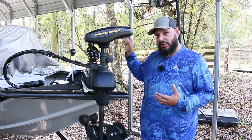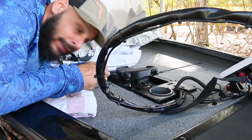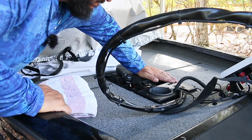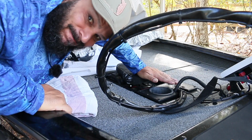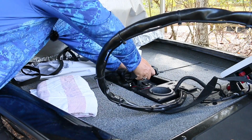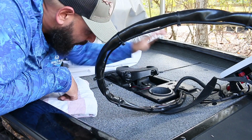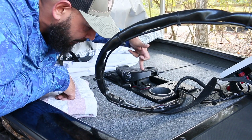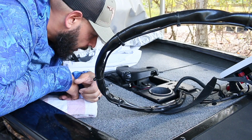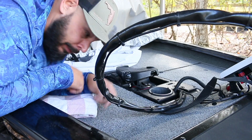So I'm gonna get the camera up here and show you how hard the pedal is to move. You should be able to see how hard I have to push to get the turn. Should not be like that. That pedal should be able to rock by hand by touching it. So now we have what's called a dead pedal, and can't steer the boat. That sucks big time.